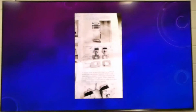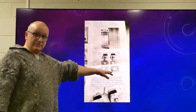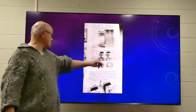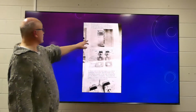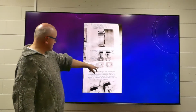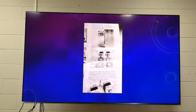So there's the kit as it comes. You've got these two little plates which go right into the machine, the motor plates that the motor's attached to, and you've got these little flywheels attached to here, which is where the belt comes through from the worm gears and attaches to the motor. So it's no longer this cog and wheel thing, one wheel turning another wheel. It's just a belt turning a belt, a bit like a fan belt in a car, I suppose.